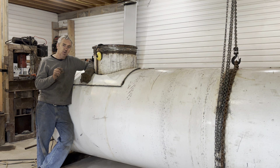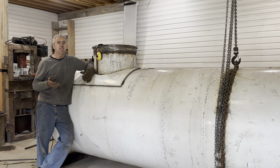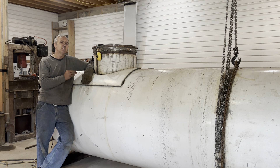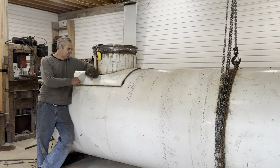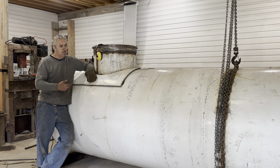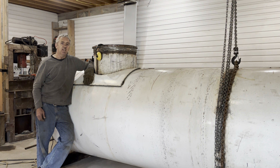Is a half-inch gap sufficient? A radiator has little tiny gaps, and it's the contact between water and steel that does the cooling. I don't believe it's the volume of water that helps, but I don't know. I need to know soon because this weekend I'll probably start fabricating that. I want it in the front, because it's a nice heat source. This submarine is going to be used a lot in the wintertime — minus 5, minus 10 degrees Celsius — and the lake water is cold. By having that keel cooler up front where the passenger is sitting, it'll radiate heat into the occupant space and give us a heat source.